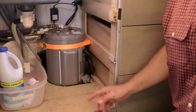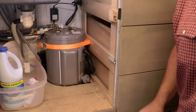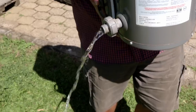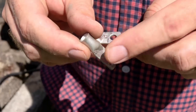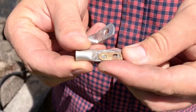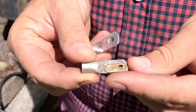When I released the original water heater video I got some criticism that I wouldn't be able to drain the water tank because the drain port is buried down in this panel. I've dug through my parts bin and found two two-gauge terminals that will work well, and we need to solder them to the wire since I left my big crimper back home in Canada. I've flattened a little extra on this lug so that once the wires are soldered in, I can solder this brass bus bar in place for a little extra meat around the hole and a guide for match drilling.